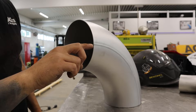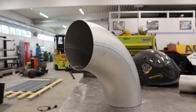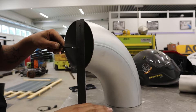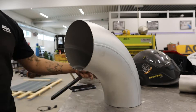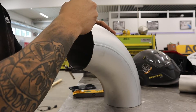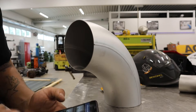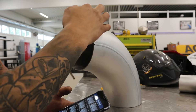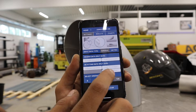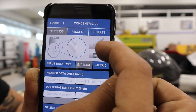What we need to do now is mark out where the center of the pipe is here and mark out the center of the pipe there. When I do this I use an app, so it can give me the right measurement for where I will cut the elbow. This is how it looks — when we cut it, it will be fitted on the straight piping like this.